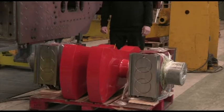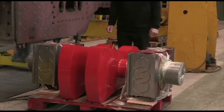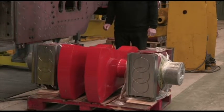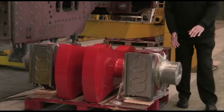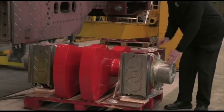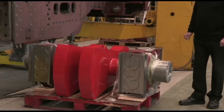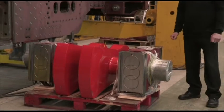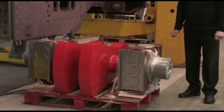This is the newly completed crank axle assembly for the 2007 Prince of Wales. Key features are that we have increased the diameter of the axle where it goes through the wheel and through the bearing by three-eighths of an inch. We have also incorporated modern axle design methods in the detailed profiling of the axle.